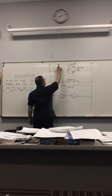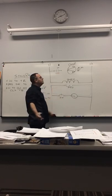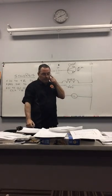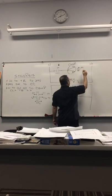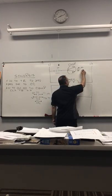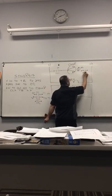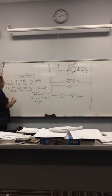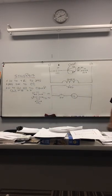We're going to put our contacts in there — normally open, CC1. We come over here and do this: CC1, normally open. Normally they don't always write 'normally open' on there because they expect you to understand it. That goes to common. On our capacitor side we also have to have that set of contacts, so we put CC2, normally open — which is right here.